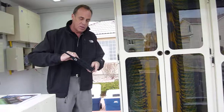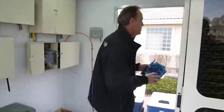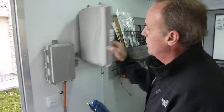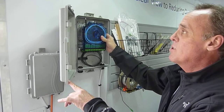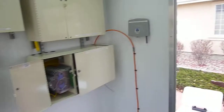So it's a totally tool-less installation, which makes it real simple for deployment of the cassette. We can also take this same cassette, take it out of the chassis here, and we can mount it. If you don't need a protected side, you can mount the cassette right inside this box. This will do up to 24 terminations. It's about a third of the cost of one of the metal boxes here.